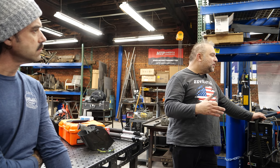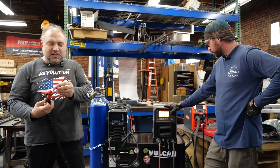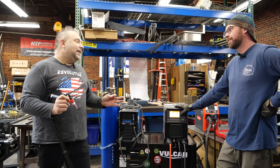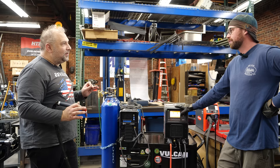There's a lot of mysteries and conflicting information on gas flow with TIG welding. Some guys say if you have a number five cup and you weld aluminum, you only need about eight to ten CFH because of the opening being so small and you're so close. I've heard that a lot — guys at like 12, 13 CFH. So I hear guys that are under 10, and it's really hard to read on a gauge, especially on a flow gauge like this. It's almost impossible to read because the accuracy on those is not all that great.